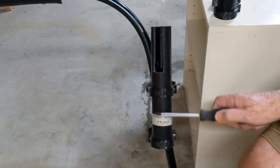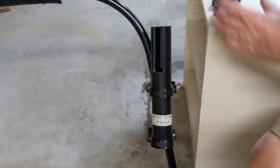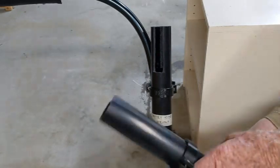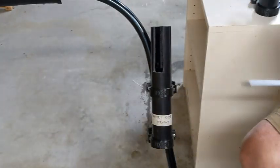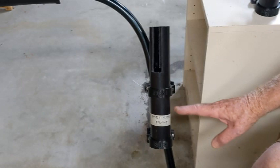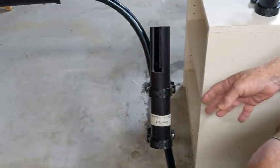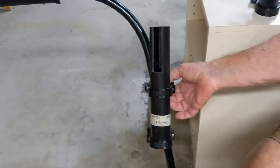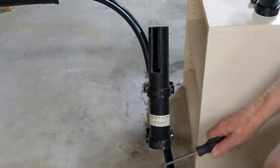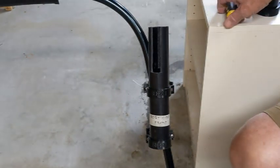The distance from this lip to this lip is designed to be three and three-quarters inches. When you receive this, it will be preset to three and three-quarters inches, so don't move it very far from there while adjusting — that's what's adapting to the slope. Notice the height: it's got to be on a straight part of the stabilizer bar ahead of the curve. You probably want to get it as high as you can while the bar is still straight, to leave room for your rod butts underneath. The rod butt will clear the lower part and the brace on the inside.